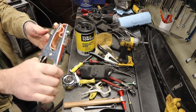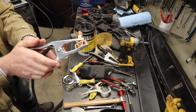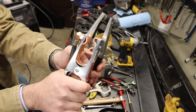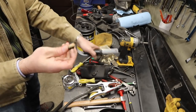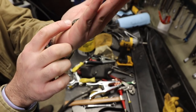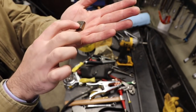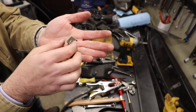So that is a nice new ground clamp. I highly recommend looking at this — even if your welder is new, getting one that's a little better. Even if it's not this one, I'm not endorsing this one. I'm just saying, take a look at your ground clamp. Look at the difference between the surface area of these things. This is the original piece from inside — basically the surface area, when this wears down from all the popping and spitting, it ends up just hitting the bolt. So I'm clamping to the bolt instead of the more conductive material. Plus, this is brass, not copper.